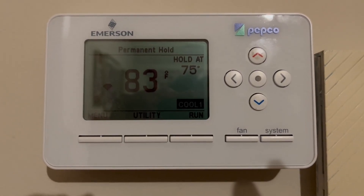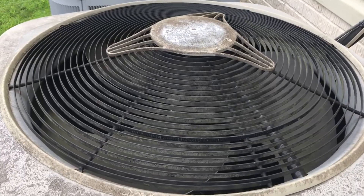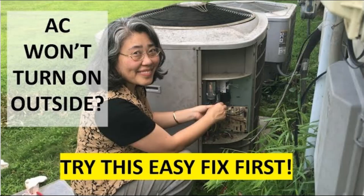It's summer and when your room is not cooling down to the temperature set on the thermostat because the air blowing out of your AC vents is not cold and the outside AC unit's fan is not turning, then the number one culprit is a bad run capacitor, which costs around $175 at the low end and over $400 at the high end to replace if you call an HVAC technician. But replacing a capacitor in an air conditioner is an easy DIY fix with the part costing less than $20 from Amazon.